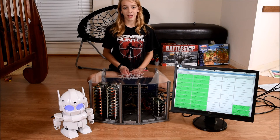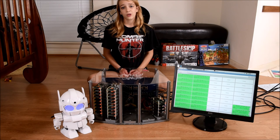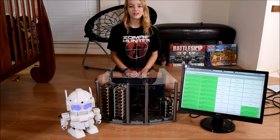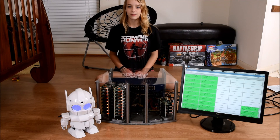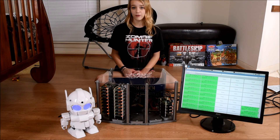I have also installed Python and OpenCV, which is open source computer vision. So when I get Rapiro's camera working, I will be able to use facial and text recognition through Rapiro's camera. I also want to install a sound card, speakers, and a microphone inside Rapiro. Once I have done that, I want to install Jasper on my supercomputer, using Google's text-to-speech and speech-to-text software, which will allow me to use voice control on Rapiro.